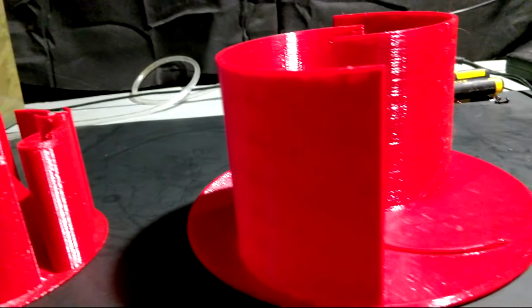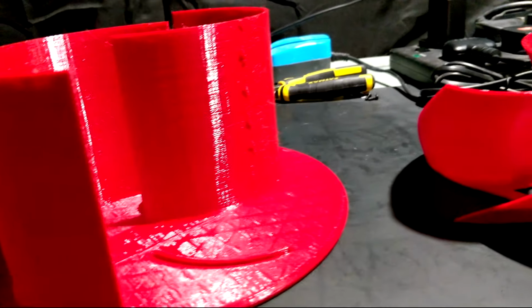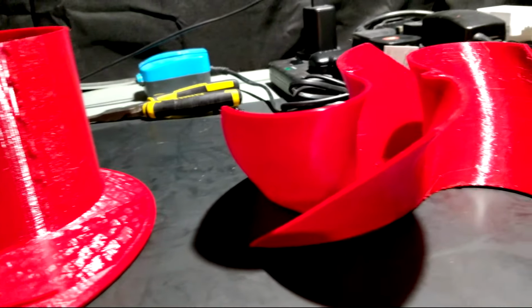The Savonius and the Ugrinsky are drag type turbines. That means wind pushes against them and that's how you get motion. Whereas lift type turbines rely on the vertical draft of the wind in order to push the turbine in a particular direction. And I think this is kind of a combination of those. Anyway, enough chatting. It's time to see how all three of these stack up.